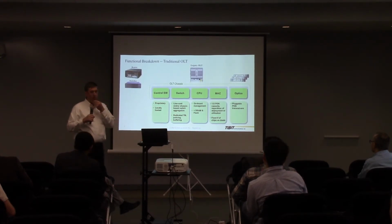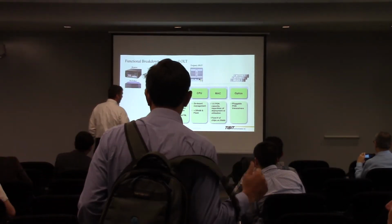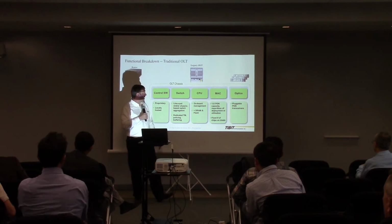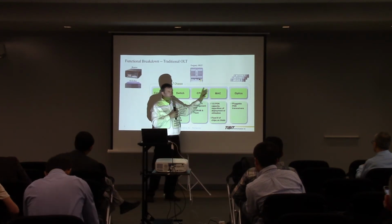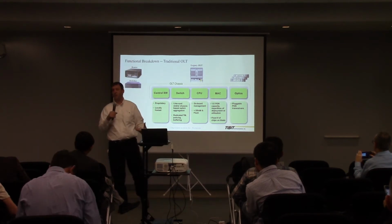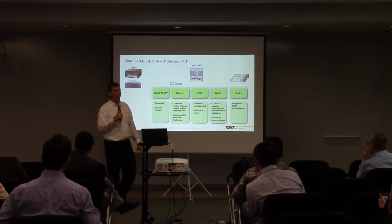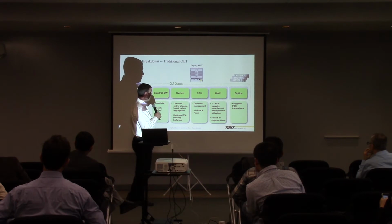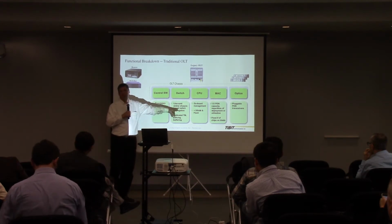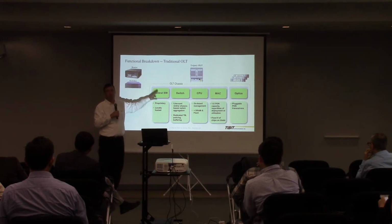So I kind of start with, what did PON look like? Still today, these are OLTs that are deployed, but a legacy OLT. You have a modular component in that you have pluggable optics into an OLT, and the rest all fits in a chassis, right? So you have what could be line cards with a dedicated MAC, and typically, it's what you've got in a line card. You have a fixed capacity. There's no way to adjust that by an individual PON port. You have a MAC that's providing service to 1, 2, 4. I think 8 would probably be the maximum number of PON ports or OLT ports from a single MAC. Probably an onboard CPU and the memory you need to drive that. Perhaps at a line card level, but certainly at a chassis level, you're doing switch aggregation depending on the vendors. And then in the legacy OLT world, you have software control directly on that chassis itself.